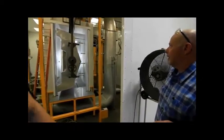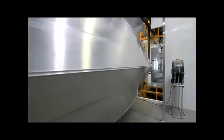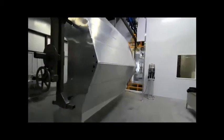Then the boat is turned sideways and gets a coat of powder paint applied to the bare metal. This is done by a machine for an even coating. So how does the powder adhere to the metal? From an electrostatic charge. The powder is positively charged, and the boat has a negative charge. Opposites attract, and the powder adheres.